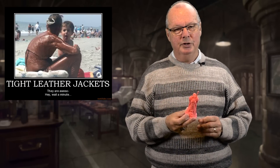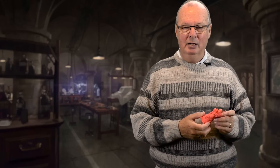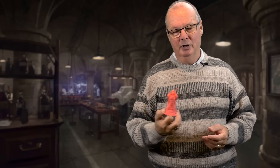A couple of things about ABS: ABS is not UV stable. So if you want something that's going to be outside and it's going to have any type of strain on it, ABS won't cut it. I printed some parts for my caravan — it was a circlip — it worked really well for about a week and then just snapped like chalk. UV is a problem with ABS. You can paint it of course, but if you want something UV stable, look at your PETGs and those types of things.